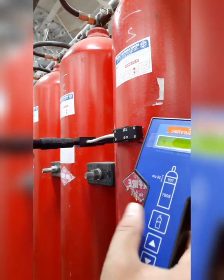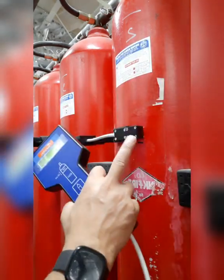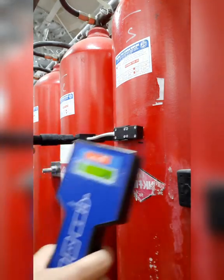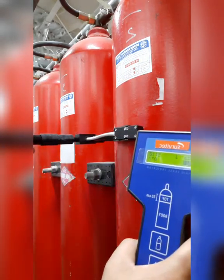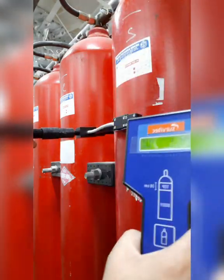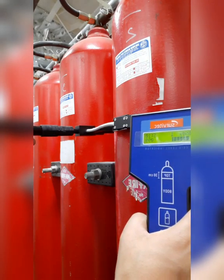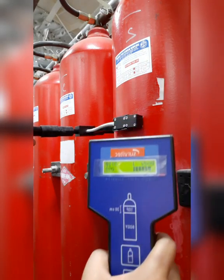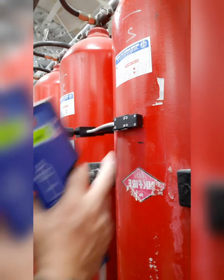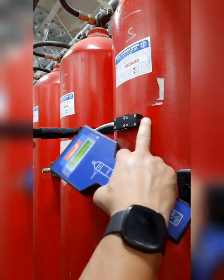We will start and see how much it is right now. We have to press it firmly so that all four studs are in contact — then only we will get a good reading. Right now it is showing 77, so we go a little higher and press very firmly — it is showing 101. This is the correct level for this cylinder; we have CO2 liquid level until this point.